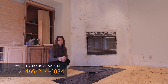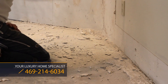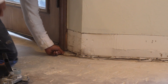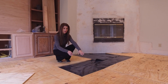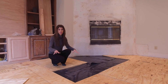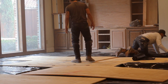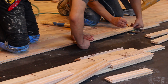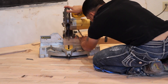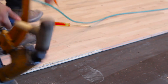In this home they've decided to completely change the floor. They cleaned the slab this morning to make sure it's even and to remove all the glue and quickset from the previous flooring. Then they put down plastic and are now covering it with plywood — this entire floor is going to have plastic and plywood. After removing the baseboards, they're going to install red oak or white oak, finish it on site, hand-scrape it, and stain it. Then the baseboards will go back up.